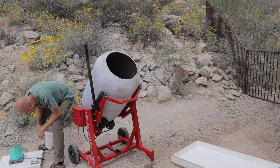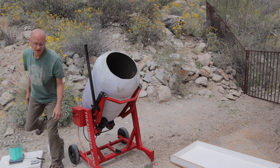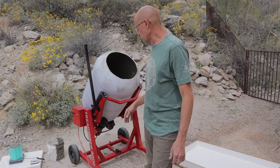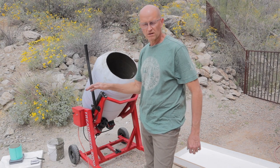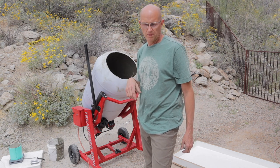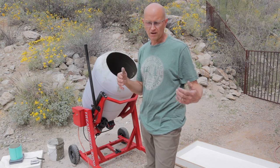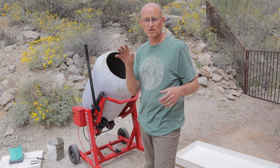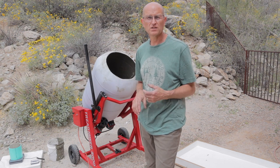We are 3.08 pounds — approximately, almost exactly 3 pounds. I'm a little high on the amount so I'll just call it 3 pounds. If that's one-tenth of a cubic foot, then right now we are sitting at 30 pounds per cubic foot. I'll put up a chart that shows exactly what the tensile strength and compression strength is of cellular concrete for each cubic foot at whatever density you're mixing.